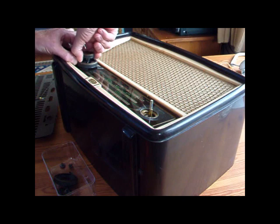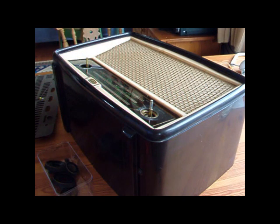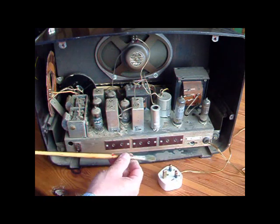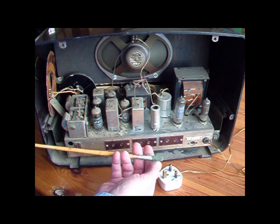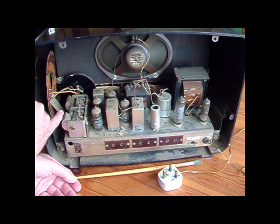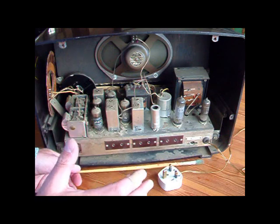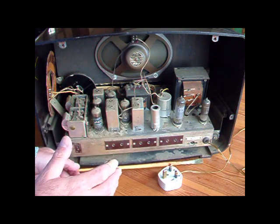I'm working here on the kitchen table — I should in fact be working in the workshop, but my workbench is like the bottom of a baby's pram at the minute. Obviously I've got the radio unplugged. I'm using a small paint brush — you could use a softer one than this. I have to be particularly careful by the tuning capacitor — very, very gently. If you bend the plates on that you will spoil it. It's very difficult to recover.